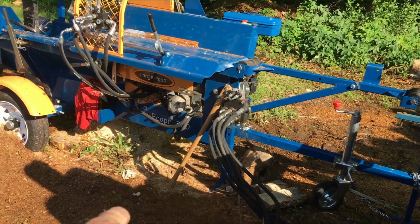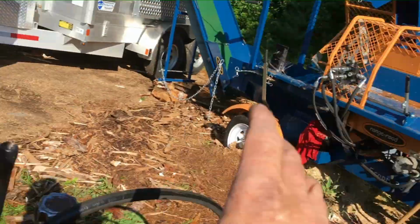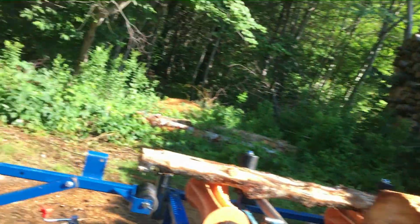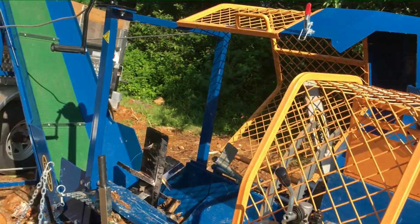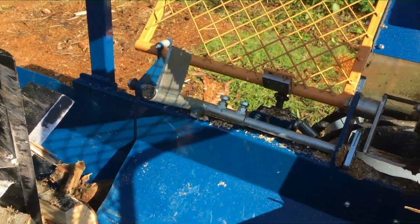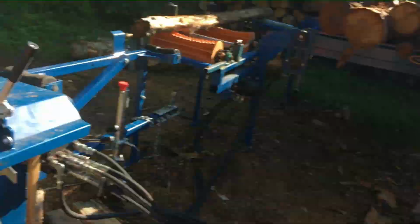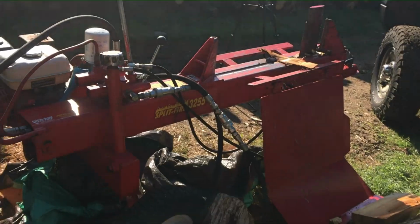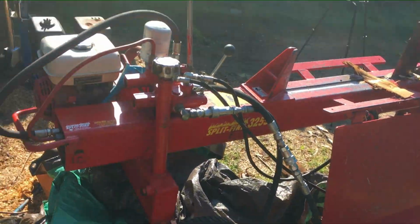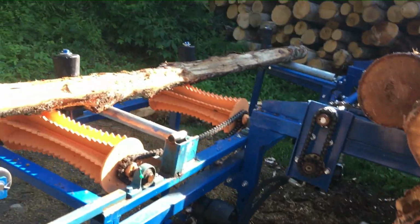I'm pointing at. So that this machine here with the pump runs that, and if I get a block or some big ugly knotted piece of wood that I think is going to cause trouble pushing through the 6-way wedge, even though this is a 27 ton splitter, some of that bigger stuff is a little cranky to go through there, I'll bring it over here, because this will split anything. I can put this big ugly piece of birch on there sideways, and it'll shear it off as if it wasn't there. So anyway, it's a neat little system.